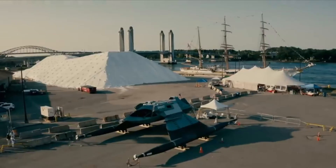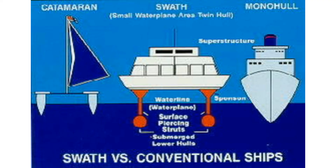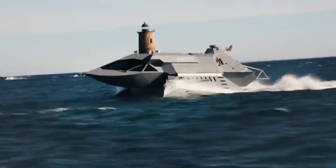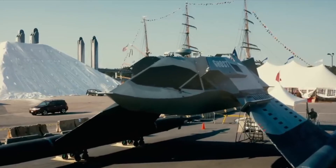Ghost is a vessel known as a SWATH, and SWATH stands for Small Waterplane Area Twin Hull. It's a mouthful, but basically a SWATH is a twin hull design that minimizes hull cross-sectional area at the ship's surface. Unlike conventional ships, in a SWATH vessel both hulls are always fully submerged underwater, hence offering less drag since less of the hull is exposed to be struck by oceanic waves. This makes it safer and easier for the ship to sail when high tides and fast currents hit.